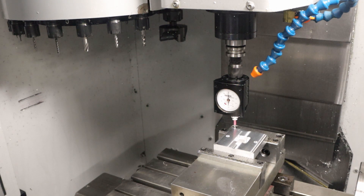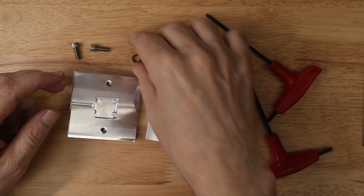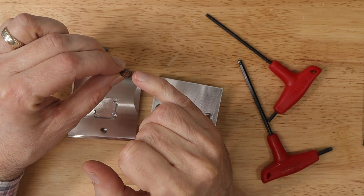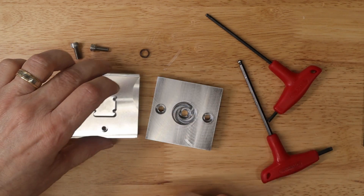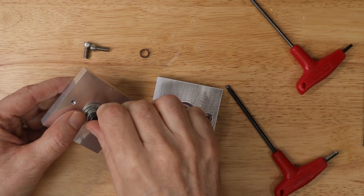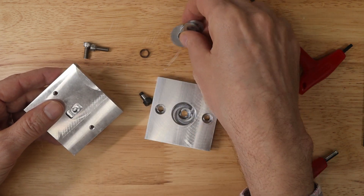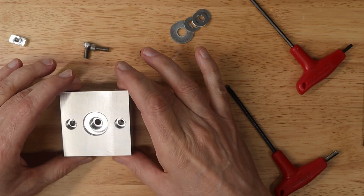That is just right, so I'll set part zero and back it away. Now it's time to assemble it. Here's the spring I'm going to use — it's a pretty cool spring, actually three layers, and about four pounds to compress it all the way. I'm going to take off the washers since I don't need them anymore — I need the shoulder bolt but not the washers. I'll put that aside and assemble this part.